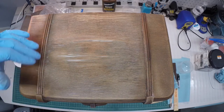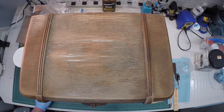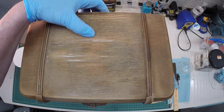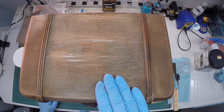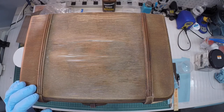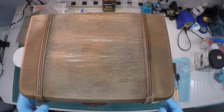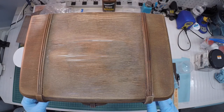Some time has passed and we've got this sanded off now. You can see the wood filler is down in the majority of those grooves, and the cool thing is there are still some open pores. When I apply some stain — like in this area where there's not a lot of filler — it will deepen up and look good. This top is going to be a very dark, maybe chocolate brown, so a lot of the grain won't show itself. This is the best it's going to be. A little more sanding on the cabinet and we're about ready for the stain.